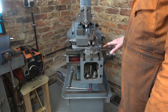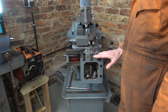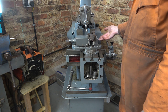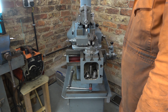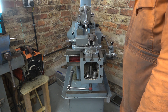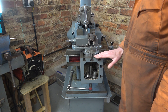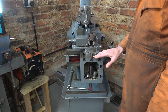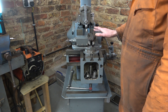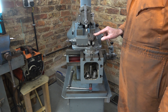When I first got the shaper I measured this table and there's about a 4-thou drop towards the front. All the operation of the slides and so on were pretty stiff at the time. Now that I've run it in and the slides are moving freely, I really need to give it a service and see if I can get that droop out of the table, because otherwise it's pretty accurate. Anyway, I'll get this out, clean it up, and countersink these holes to just make them look a bit smarter. So over to the drill.